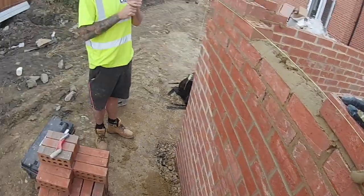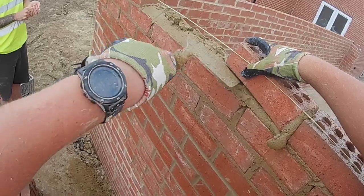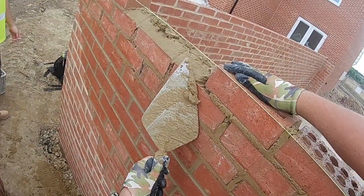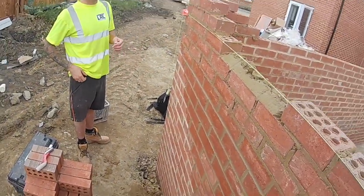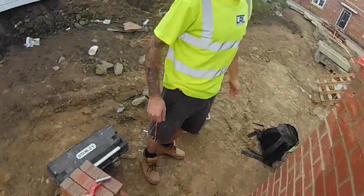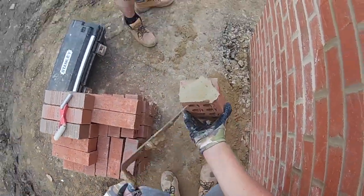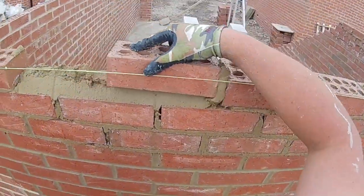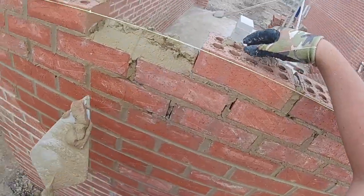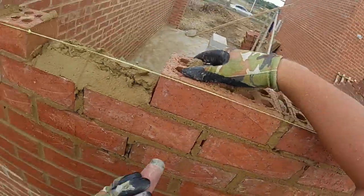Even if you'd normally get there at like 8 o'clock like I used to, or you only get there at 7:30, get there at 7. Whenever the site opens up, you get there and start laying, because it's the only time you'll get a head start on the day. I've never been a fan of starting that early, but with the ready mix right there, it is so beneficial, because you don't know when the ready mix is going to run out in a day, and you're either going to be waiting for a delivery, because it's always the case if you're working on a site with ready mix, there's always a gang flying through it and then taking everyone else's tubs.